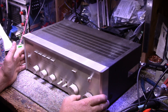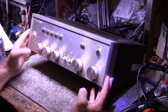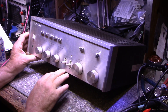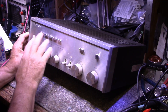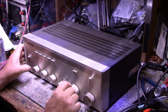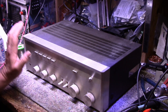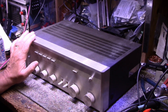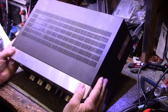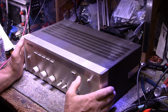So what I'm probably going to do is give it a good cleaning — it's filthy. I think I lent it to somebody and they brought it back like this. It's got fingerprints all over it, just disgusting, a lot of dust on the knobs. I'm going to ultrasonically clean those. Basically what I want to do is a full recap on this and probably upgrade the power supply capacitors.